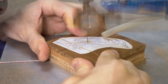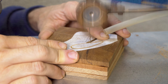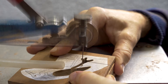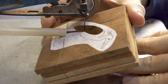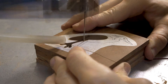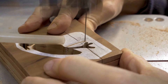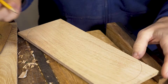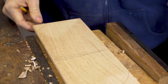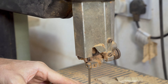The first scroll saw project we're focusing on is the bird that features on the logo of the school, and that is the heron. We cut a profile all around but we're also cutting into separate parts — the body, the legs, the head, the beak — they're all cut into separate pieces that will be used later to almost create a jigsaw. The reason we're doing it in this style is the four different colours of wood will give us contrast and interest in the finished products.